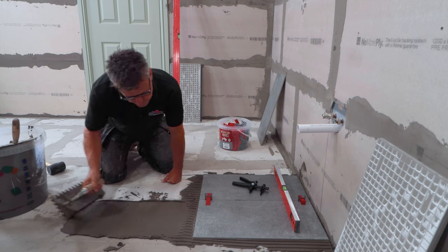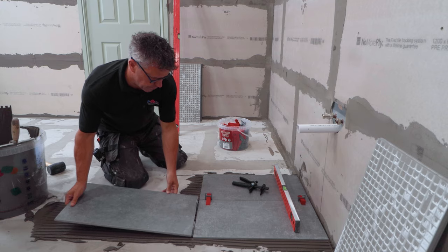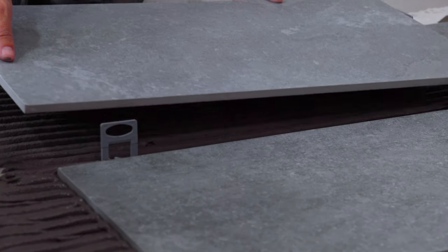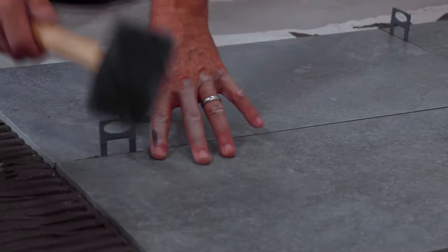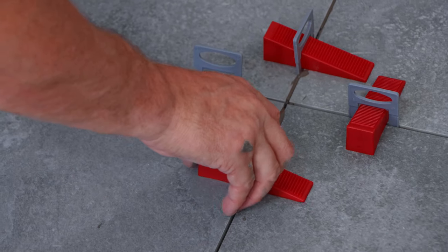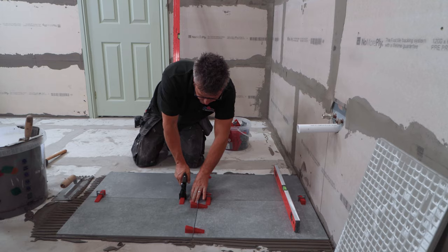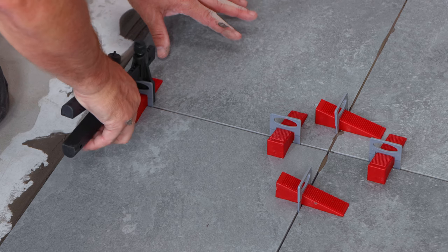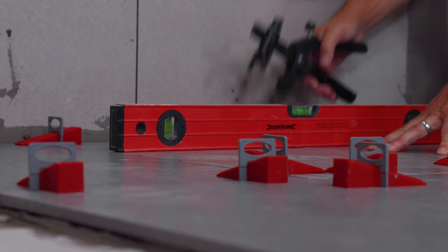Then one final tap with a rubber hammer, squeeze both clips a little bit tighter, and it should be perfect. Then I'm ready to fix the third tile in place, again spreading just the right amount of adhesive. Placing two further base clips under my first tile while I lower the third one in place, making sure the edges of the tiles are flush to create a straight line. Pop in the wedges, two further base clips, and then your fourth tile is laid into position. Give it a gentle tap down with your rubber mallet, squeeze the wedges with the application tool — now you've got your first four tiles firmly fixed down. Check that they're square and each corner is running in line, then one double check with the spirit level to see that they're flush and level.